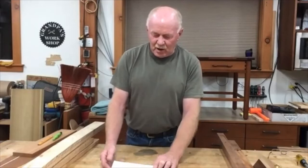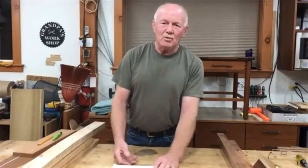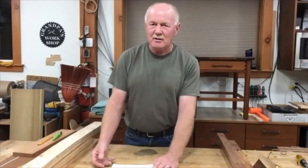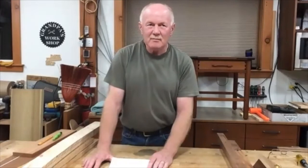And so what I generally, bottom line, end up with, if I'm looking to calculate how many board feet I need to buy, just to have a rough number in my head, I usually buy a rough mill number, which is also called hit and miss. So it's been skip planed. It's not completely clean. It's still got a lot of fuzz on the surface, so you can't see all of the grain. You can't see all of the imperfections, but you get a pretty good feel for grain direction and whether there are pitch pockets in there or anything like that, or knots. Stress fractures like that usually will show up at that point. But I generally end up at about 30 to 50% waste factor when I buy my lumber.